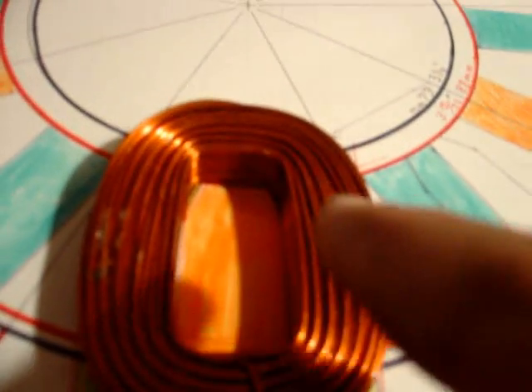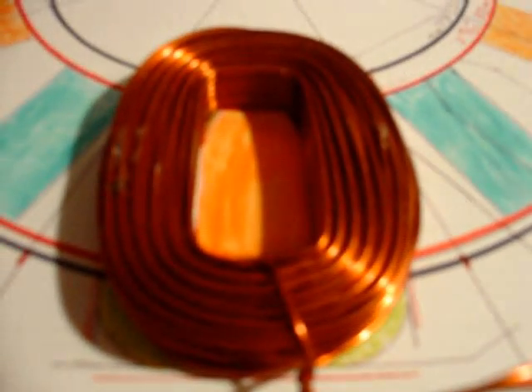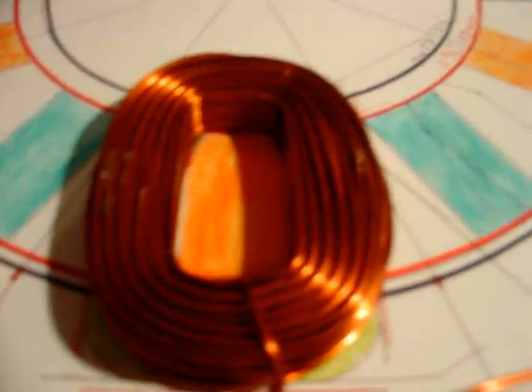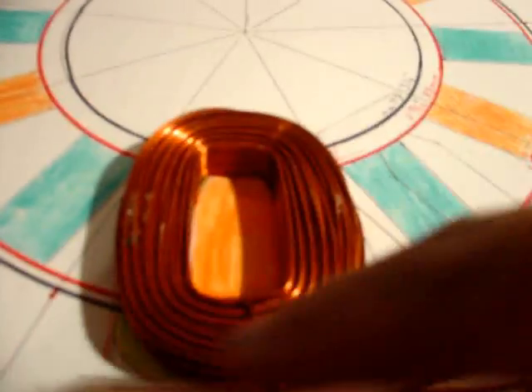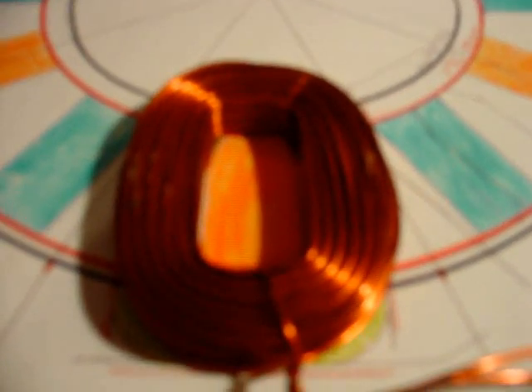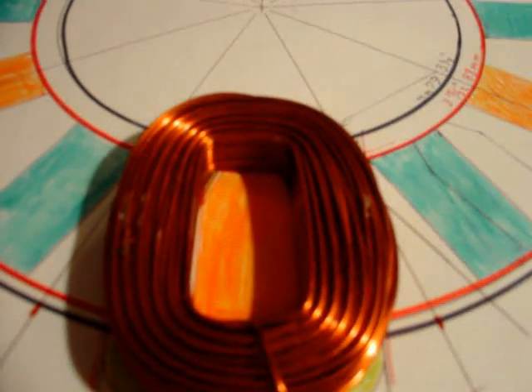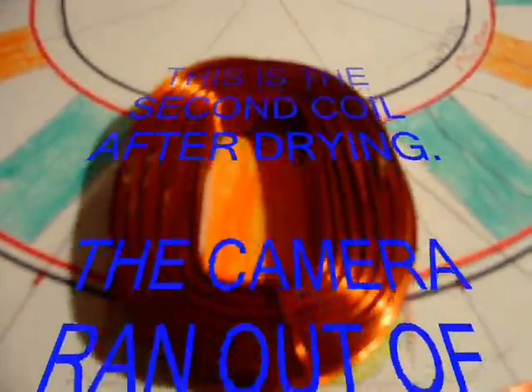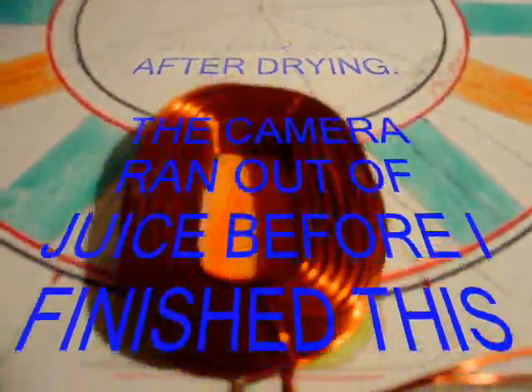I actually got a little round — we wound this one a little tighter. Something else I'm going to show you: it's a little wider here than it gets down there. After half, because of the direction it turned, the wire doesn't really want to bend. So if you wind your coil faster going down on your crank, your coil will be lopsided. If you slow down and keep a continuous speed, pressing in once in a while, you'll get a nice even coil.